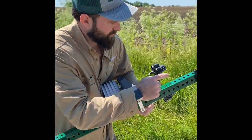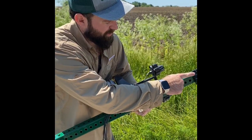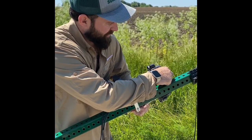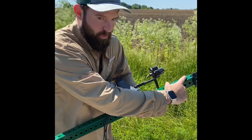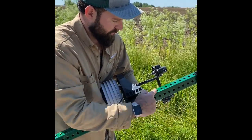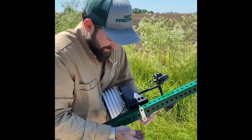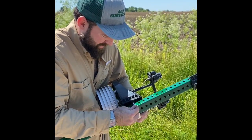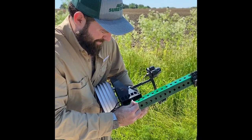All right, the only difference with this, we're not snugging it directly up with our anemometer here, because we're going to need to put our antenna extension pole somewhere in this general area here. So you want to make sure that you leave 7 to 10 of these holes free and open. Put a lock washer and a nut.